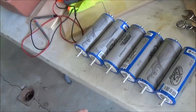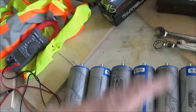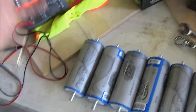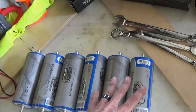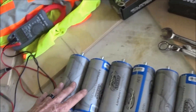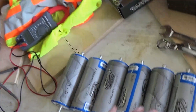You can buy a BMS — a battery management system — and 9 times out of 10 it has a balancer built into it, so it'll take care of things for you. You get a monitor that tells you the voltage and charge of each and every cell. They're really great, but I'm personally not sinking $100-plus into a piece of tech like that when I can just do it myself. I have a 7K system — 5K on bass and 2,200 on mids and highs — along with a CES 320 amp alternator, so this 40 amp hour bank will just be enough to meet my needs. That means heavy demand on the cells and I'll have to equalize them often, but if I add another bank it won't be an issue.